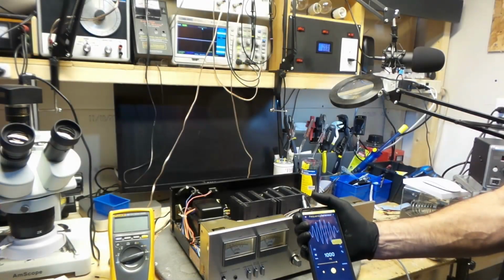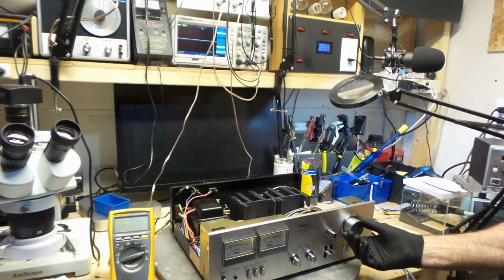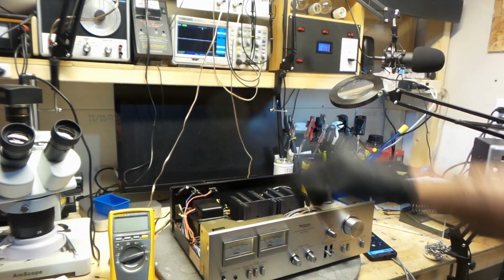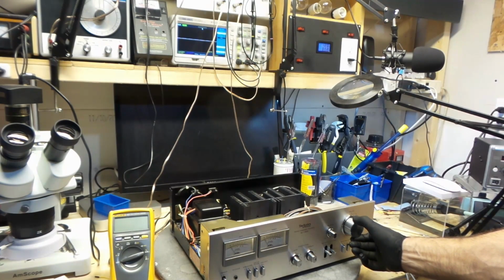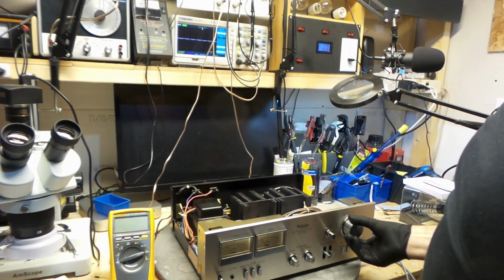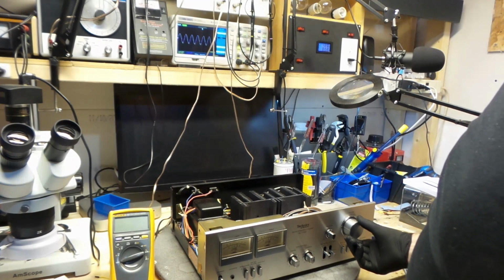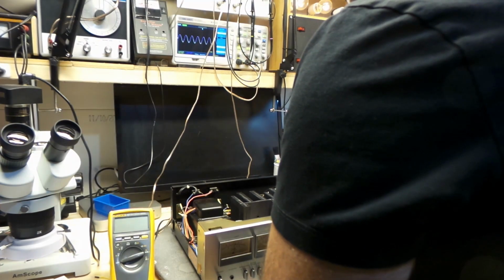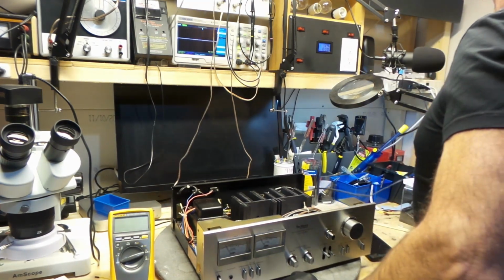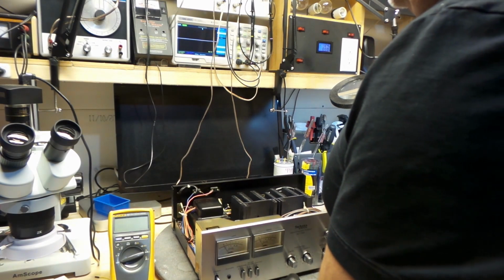1000 hertz of frequency. Let's see what we get. And that's hooked up to my scope. Somehow this noise is really driving me nuts, so I just mute it, and there it is. 8 ohm resistor, and I'm having an issue here. It's because I haven't pulled my dim bulb. I'm going to switch it to a regular outlet, and here we go.